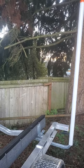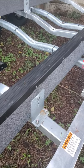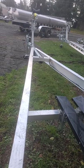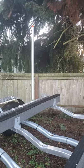It's very adjustable. You can see the bunks can move up and down, in and out, forward and back — all six directions. The target bunks as well can do that. These target bunks are designed to point the bow of the boat towards the roller, and then the white poles control the back of the boat, so it's a very easy system to launch.